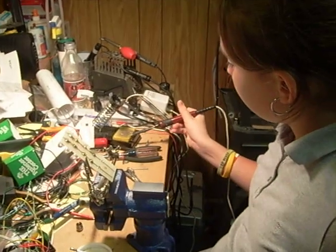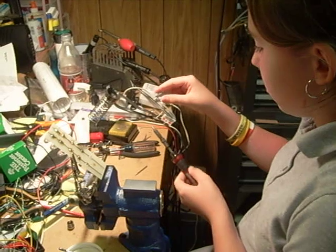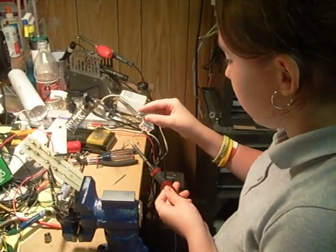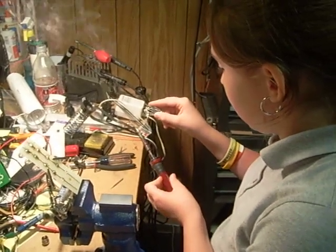Okay, then we have to tin it. Take a little solder, tap it on the iron and melt it a little bit more. You want a coating that protects the tip from oxidation — that way we don't have to buy a new tip every time we turn it on.